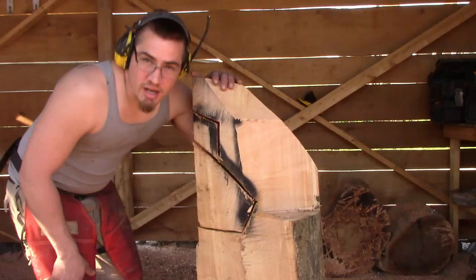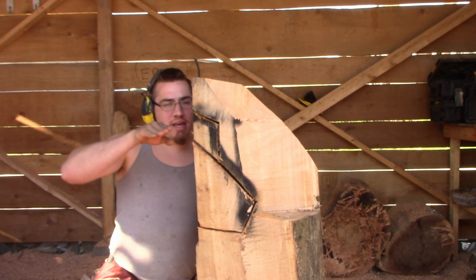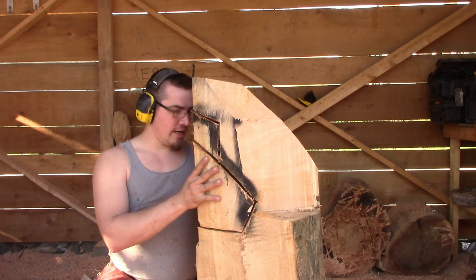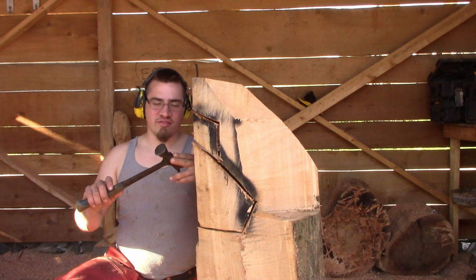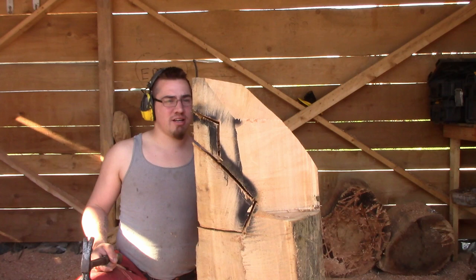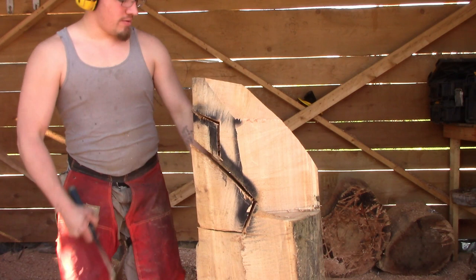I personally suggest that if you're just starting off as a beginner, don't dig the saw in like I did. Make your cut and then meet it again, then dig your saw in, and watch the top groove so you don't go too high or too low. Here's a quick trick: this is a hammer, you can find them at your local hardware store — great for smashing things. Sometimes you make a cut and don't always go through, and you don't want to stick your saw back in and cut too much off, so you just grab a little hammer, stick it in there, do a little twist, and it takes the piece right off.